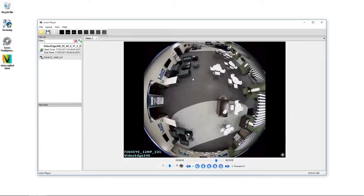This design trade-off increases the pixel density in the viewable area and allows for more of the rectangular image to be used — fuller usage of the image sensor than if the fisheye circle was reduced to fit inside the rectangular shape of the sensor. That gain is actually a 9% increase in pixel density.